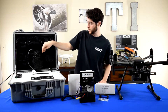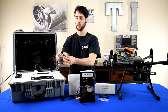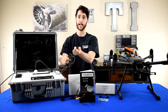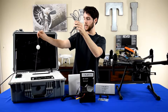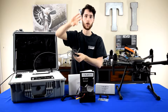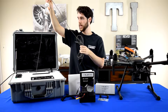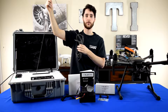Once it's on, you take this end — we'll show you in more detail — and you essentially clip this to a brace on the bottom of the drone to make sure that the tension is pulling not where the cable connects to the power source on the drone, but instead over here. It keeps tension throughout the whole flight because if it didn't, the wire would basically hang loose and potentially get caught in the propellers. As the drone flies away or goes up in any direction, it will keep that tension and spool out just enough — not too tight. You can feel that it won't pull the drone or affect the flight characteristics.